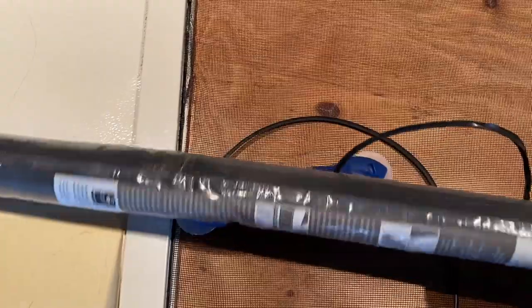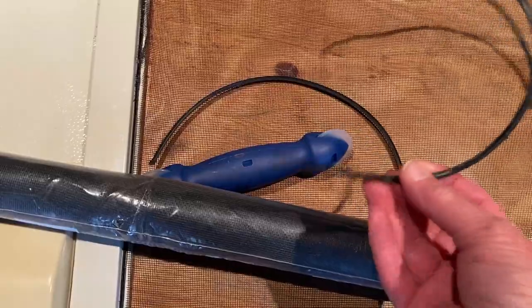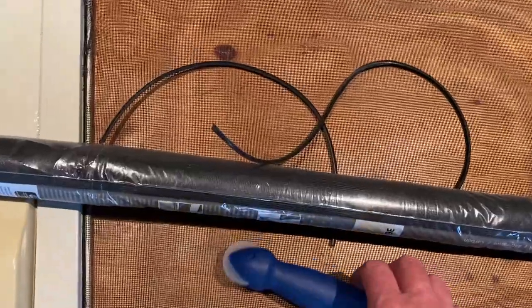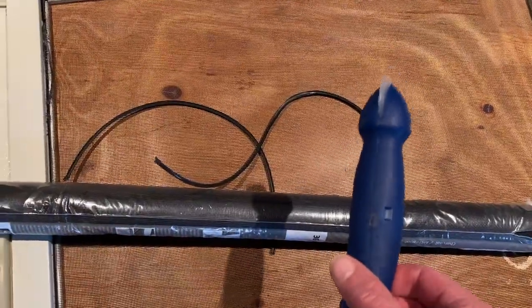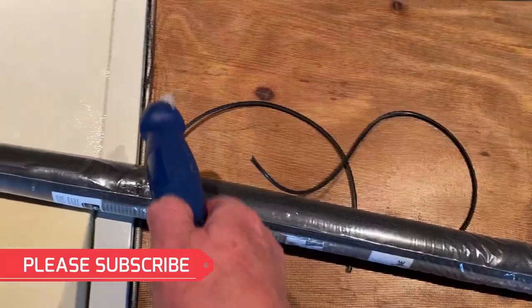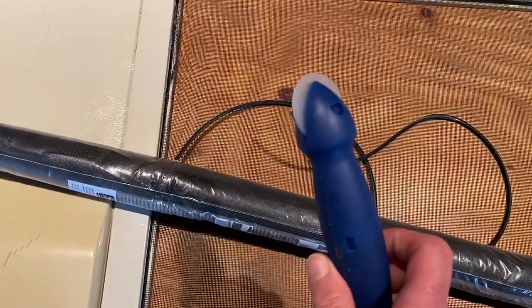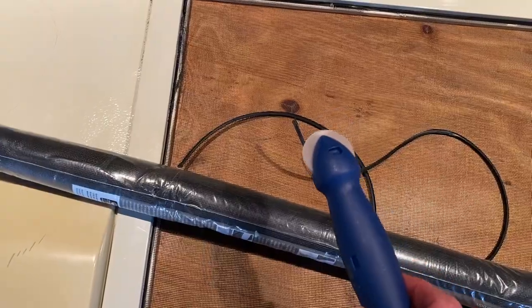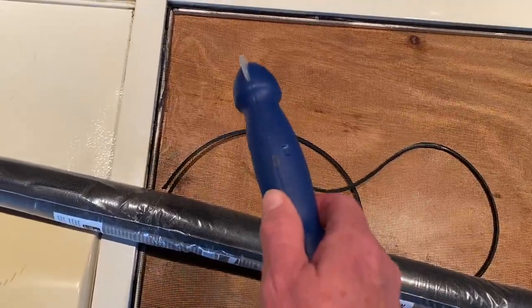I have a roll of new mosquito netting to go in there. I also have some spline, which you can buy in rolls. And I have a tool which rolls in the spline to the space in there. I'll leave a link in the description below where you can order these things from Amazon. I did a lot of these replacements with just using a dinner knife to squish the spline into the space there. And while it worked, this is a whole lot easier. And I wish I'd bought one earlier because it really makes a big difference on how quickly and easily it all goes together. So let's first start by taking out the old screen.